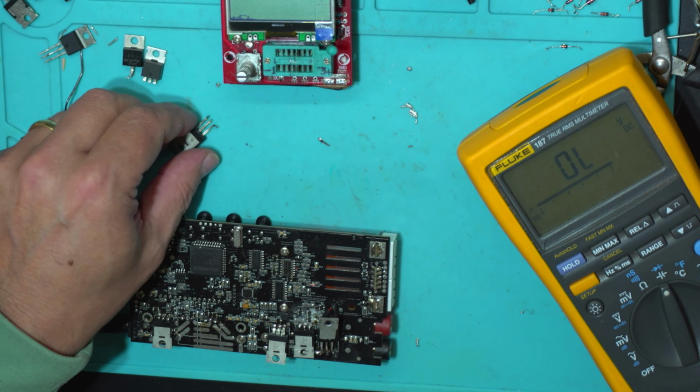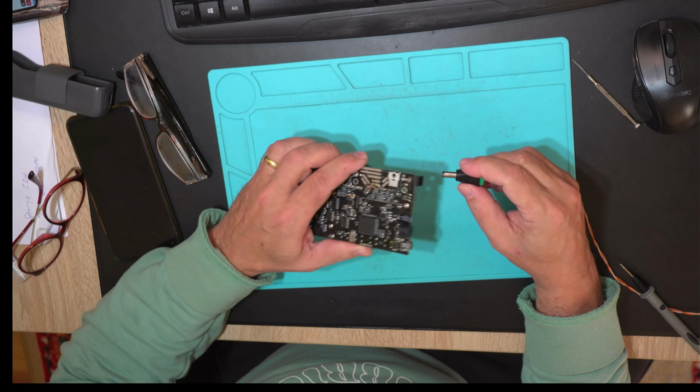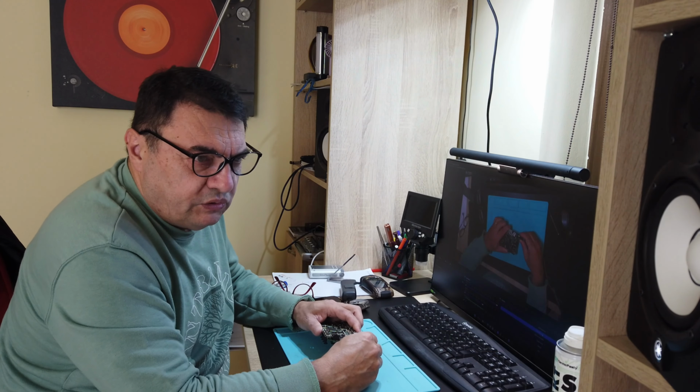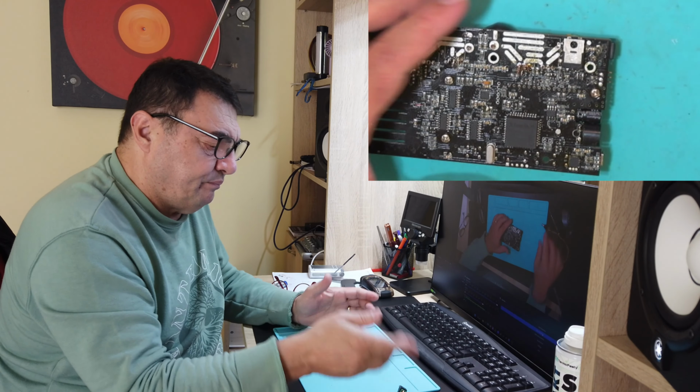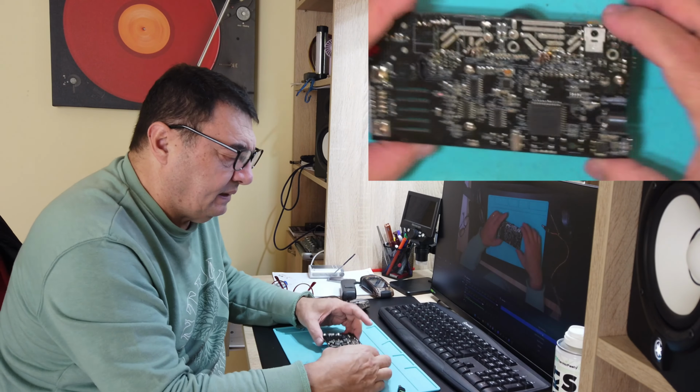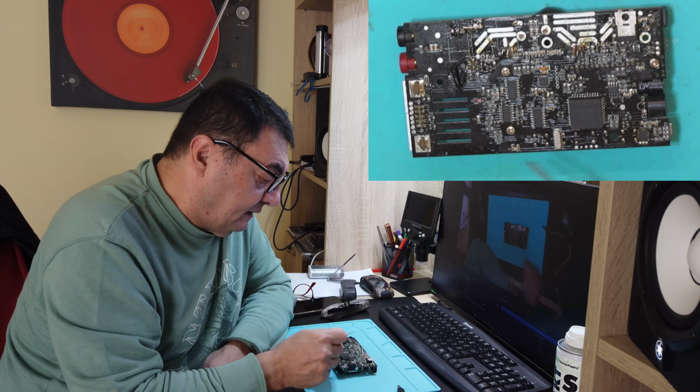Yes, so unfortunately my machine gave up, and I found the single explanation is this connector, which is improperly suited for getting into this motherboard, and I can see sparks and I can hear noises, and I'm pretty sure everything starts with this one, because it's oxidized and doesn't have a proper contact, probably gives me peak voltages which destroyed evidently the Zener diode D16, which is supposed to be 20 volts. You know, if it's getting higher than 20 volts, then it's shutting down the circuit. You know, it's shorted, it's getting short, and put all the things down.